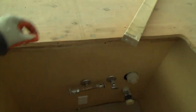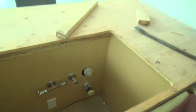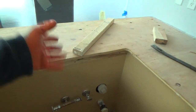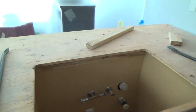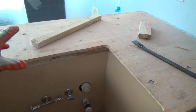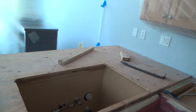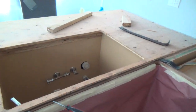Because see, when they come, they have to drill two holes for the sink faucet and, if you decide to do an air gap for your dishwasher, and if you want a soap hand pump dispenser, you might have three holes that they have to drill. Or two holes, if you just want two holes, whatever. But they don't do that until they come out on the job site. That way they review it with you on the exact locations.